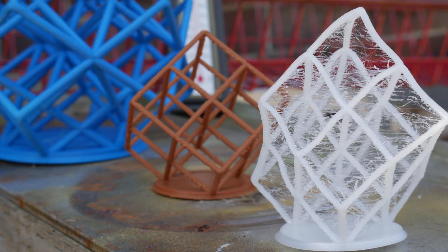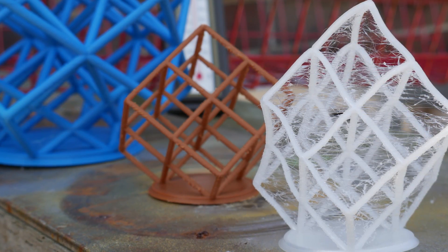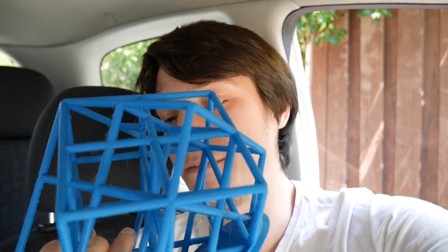So the moral of the story is if you're transporting 3D prints on a hot summer day, put them in a cooler or something. Don't leave them in the car, and especially don't leave them in a car park, because your PLA prints will end up looking like that. But if you need a bit of temperature resistance, then even though ABS is harder to print with, it seems to work pretty well. Or what seems to be a good middle ground is PET, which seems to be pretty much unaffected as well. Thanks for watching guys, hope you found this little silly video interesting. It's a sauna in here — I look forward to seeing you again very shortly here on Makers Muse. Catch you later, bye.